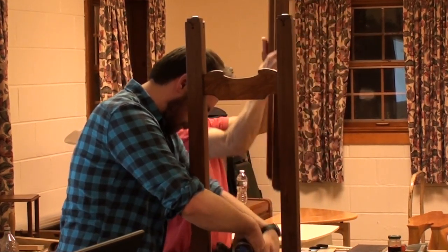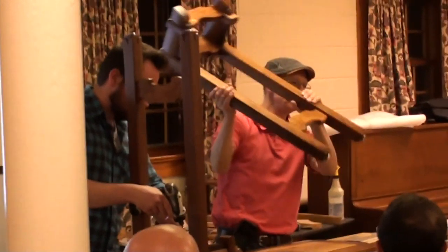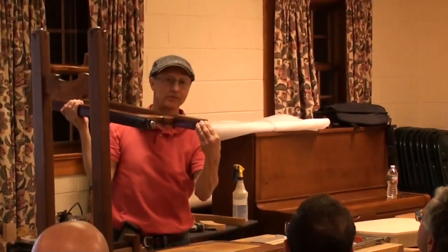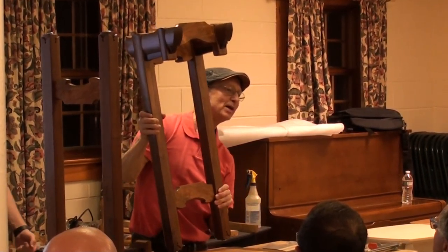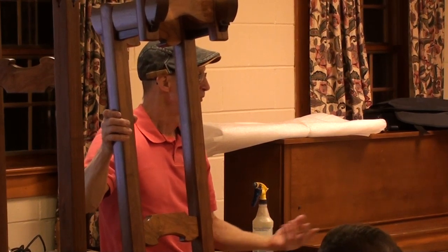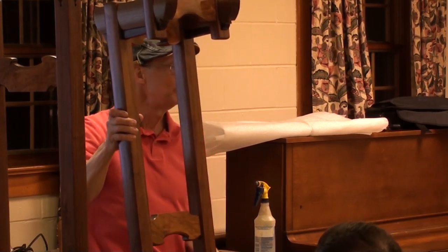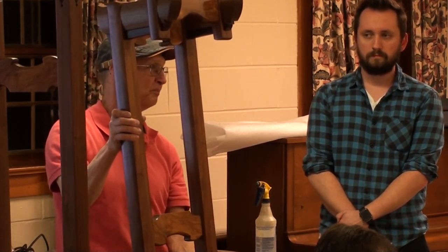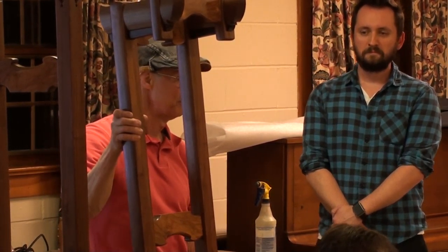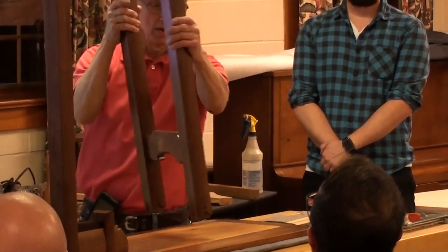And I think what we're going to do first, can you see the bottom of the legs? A lot of times, and I should show you, the bottoms of my tables always have adjustment levelers. Because if you make it perfect, you put it on the table saw flat, and everything's perfect, nobody's floor is perfect. Then if it's on a rug, it's going to rock. So levelers go on pretty early. You have levelers, you can open up the leveler to put finish on. You don't have to stick it on blocks. You already have your levelers. So that's one aspect. Another aspect.